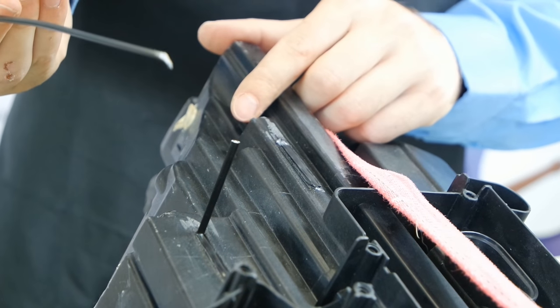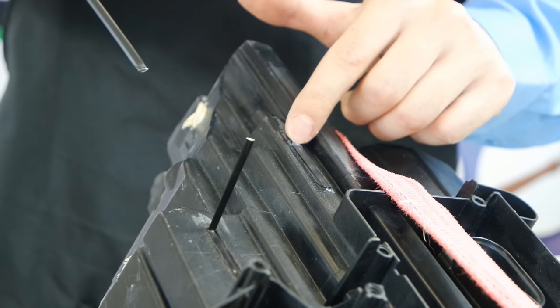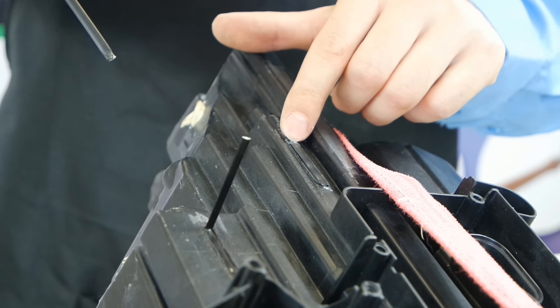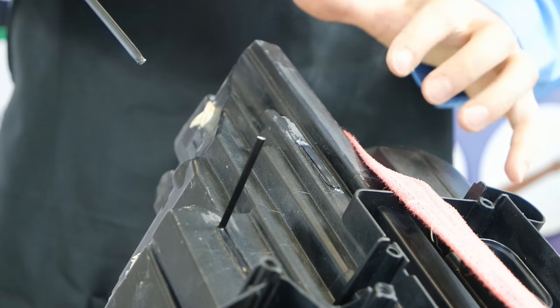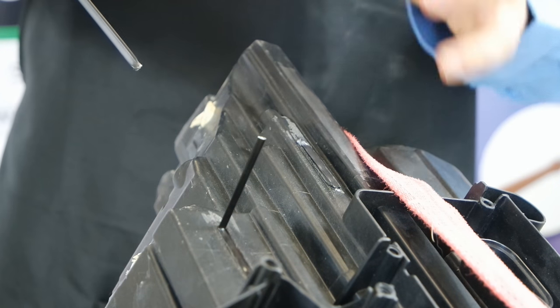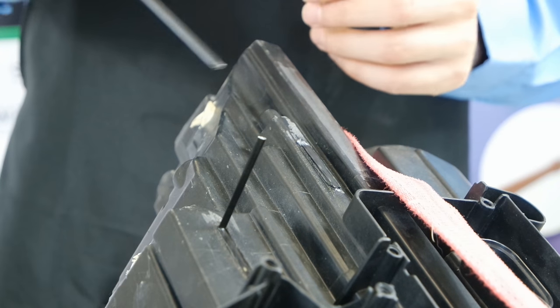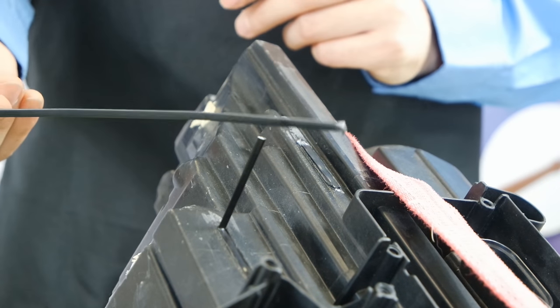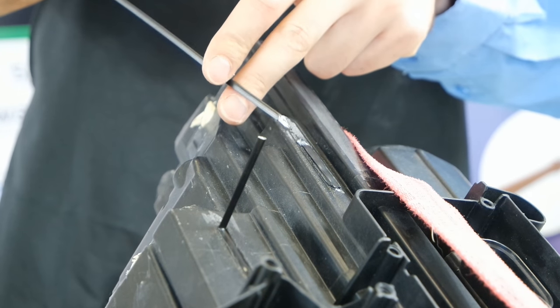So a material like that, with some additions within, like PP with 10 to 20% talc, does not pose a problem, as you can see here. Fiberglass with talc additions of 10 to 20% is no problem for welding, as I just demonstrated.